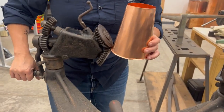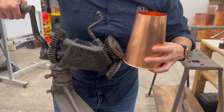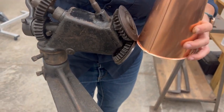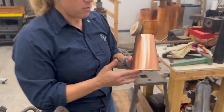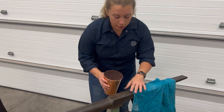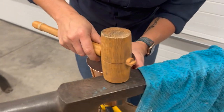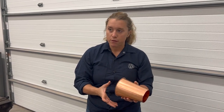We'll come over to the setting down machine. What it's doing is really flattening my hammer work so it's nice and snug. This is not waterproof - if you fill it with water it will still leak - but it's less likely to leak and less likely to bust open with time and use. If you don't have one of those, you can flip this upside down very carefully so you don't scrape the sides, and hammer from here, shifting around, allowing that metal corner to do the job of the setting down machine.